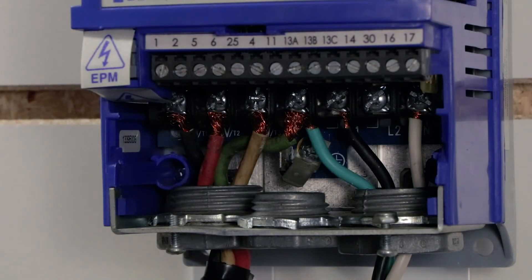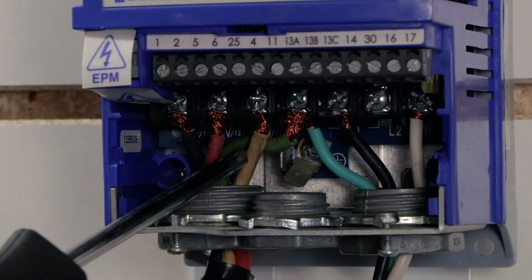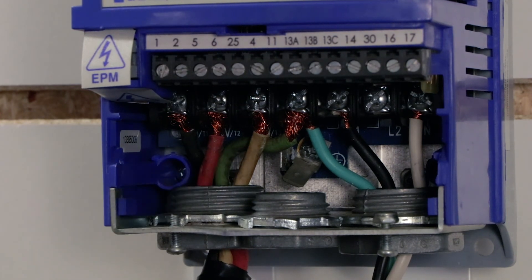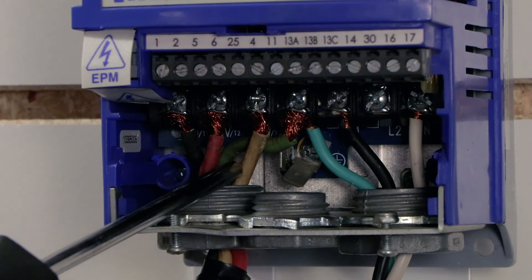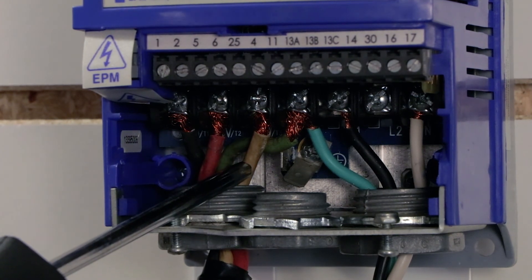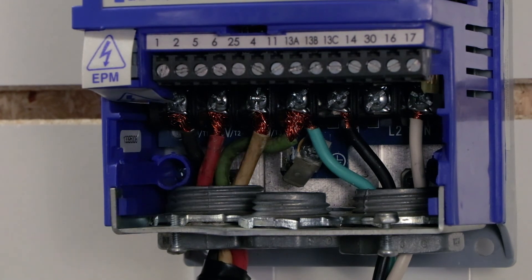For our motor lead wiring, we have three wires coming out of our motor. All three of these wires are going to be hot because it's a three-phase motor, and then we have one extra wire which is our ground wire — hopefully green in your case. Typically for a three-phase motor you're going to have three blacks and a green. We're going to wire those three black wires to U, V, and W, which is on the left side of the terminal strip on the drive. The ground of course wires to the same ground as your line voltage, which is PE again.